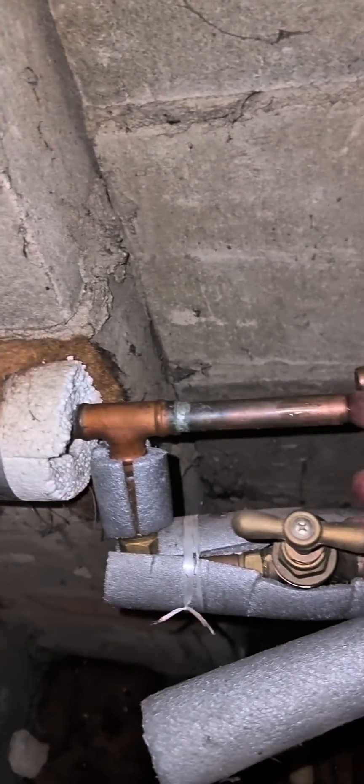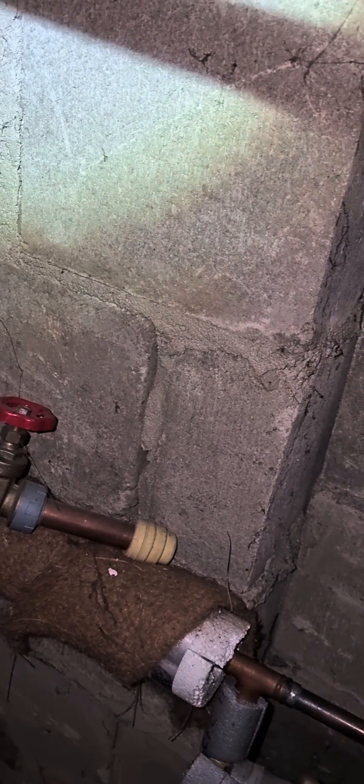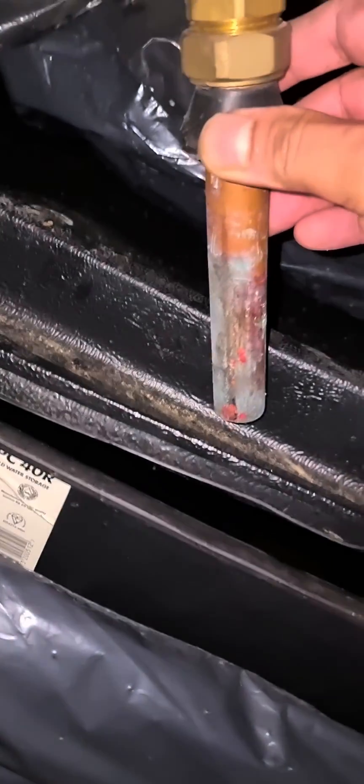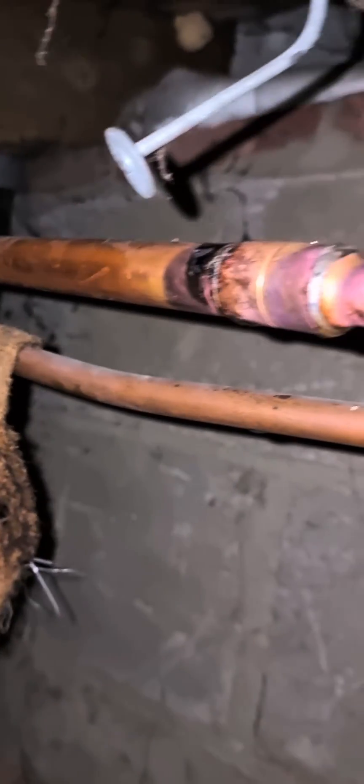This is the pipe I'm going to connect — this cold water supply back to the airing cupboard. The cold water main supply is connected to the pipe to the airing cupboard. The vent of the F&E tank is capped off. Cold water storage tank — the vent from the hot water is open, the vent from the F&E tank is capped off, and the cold main is connected and run into the airing cupboard where the cylinder is. Cold main coming in.